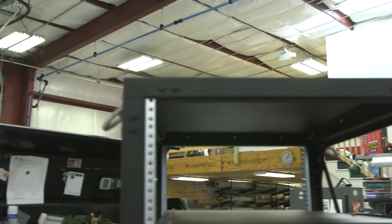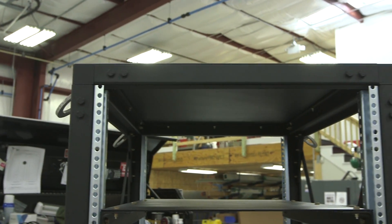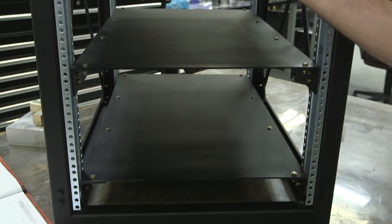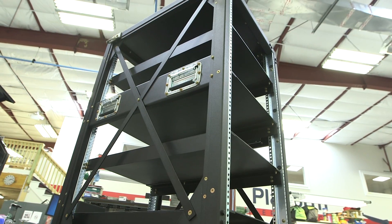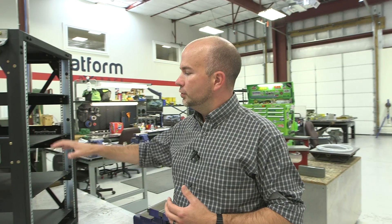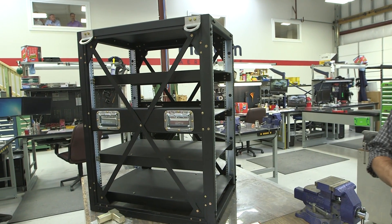Because we utilize this MX channel design in our racks, our storing capabilities are very versatile. We can accommodate various different types of shelving or bracket mounts, and we're able to utilize our custom in-house center of gravity measurement equipment to determine the CG of everything and place it in the rack to utilize the space as best as possible.